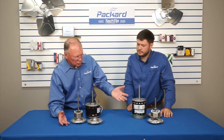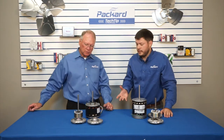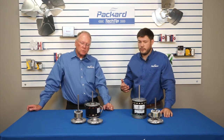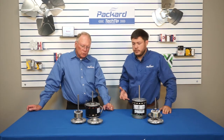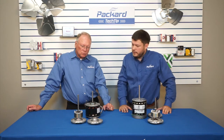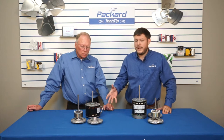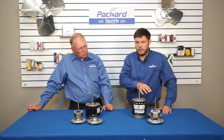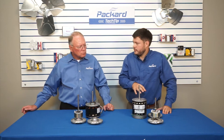Why would I use one versus the other? Typically, sleeve bearings are used in slightly lighter applications — up to about three-quarter horsepower is a good application for a sleeve bearing motor. In the right application, sleeve bearing has excellent lifespan. Once you get to either a higher load or a higher weight, you would want to move towards a sturdier ball bearing to help support the weight of your load on the shaft.